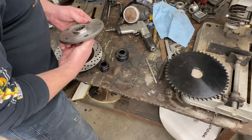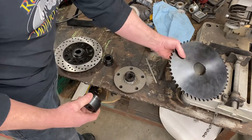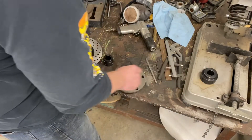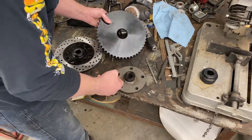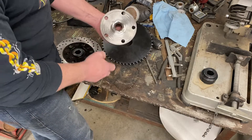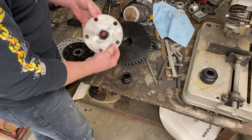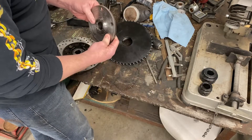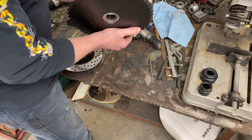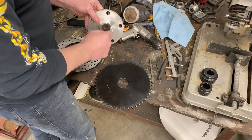So I made this part up. These are like an X and Y hub that you can weld to your sprocket or whatever accessory you're using. I took the hub, got one of these plates welded on there, and on the other side I put a big weld on. I didn't videotape it because there's a lot of time standing in front of my lathe cursing at it. Basically I cut this so I can put this on there nice and centered and then drill some holes and bolt it on.